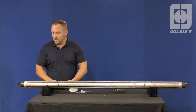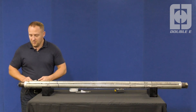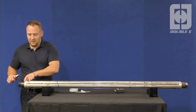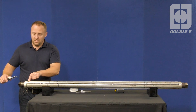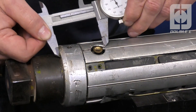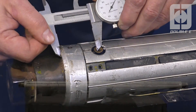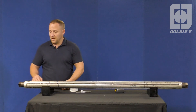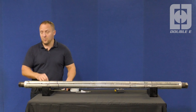Your tank valve is located on one end — in this case it's on the body. You want to measure the distance from the end of the body to where the tank valve location is, capturing the center of the tank valve from the end of the body, which is approximately 1.75. Make sure you dimension that location and indicate that it is where the tank valve is.